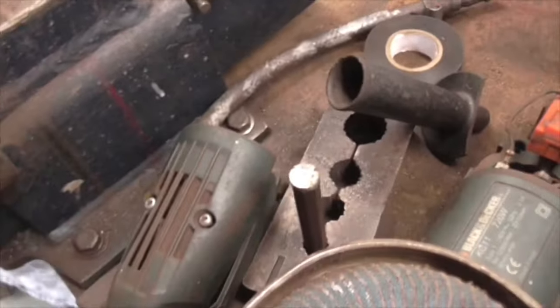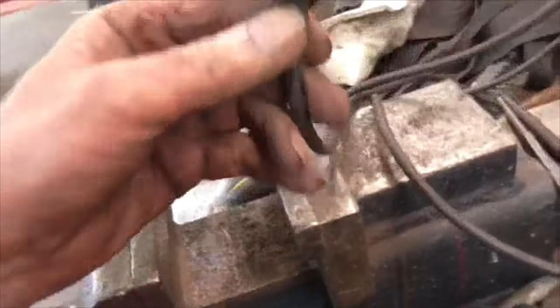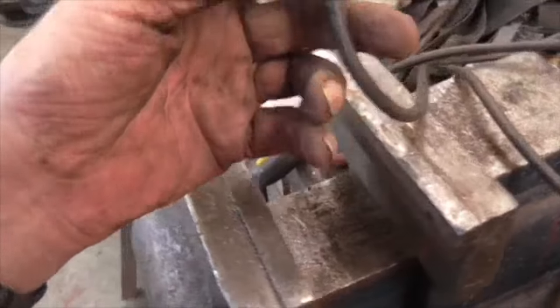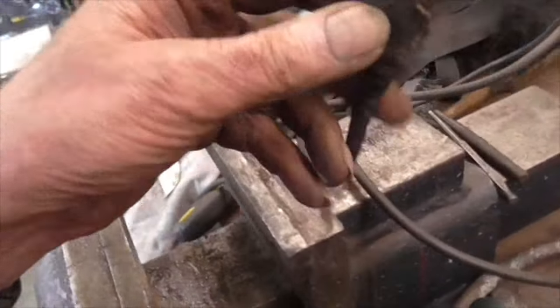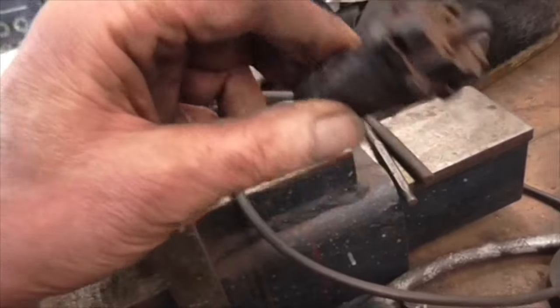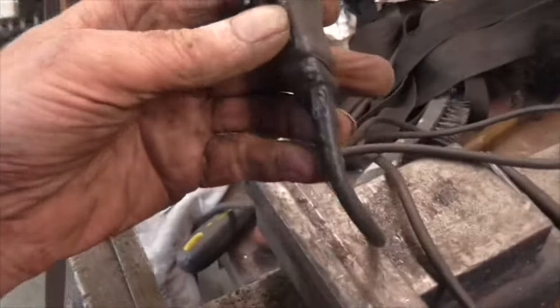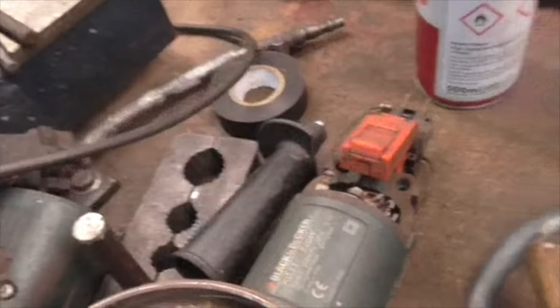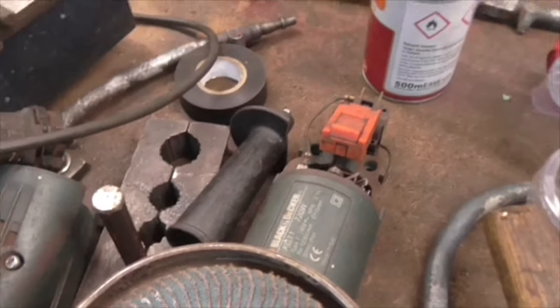It's a Black & Decker KG11, but this tool is also sold under all sorts of different labels. Unfortunately, it has this strange plug that goes onto the bottom of the switch, which is one piece with the cable, so that of course had quit, so I've had to strip that down and fill it with hot glue after I'd repaired it, but that's okay. It's just the switch was full of muck. So, I'll put it back together and I think it's going to work.